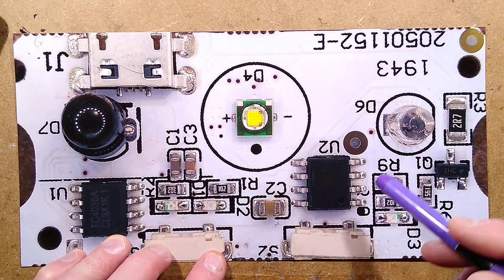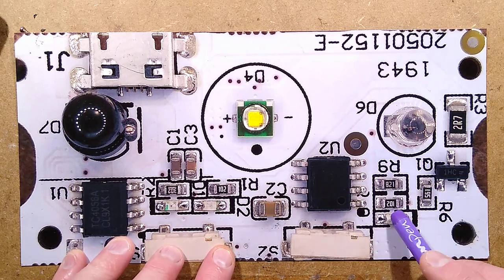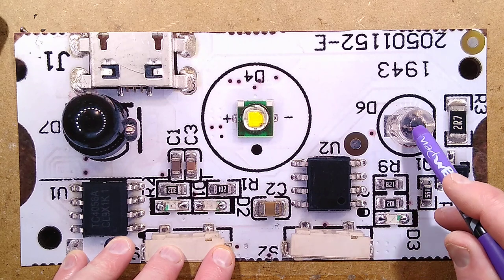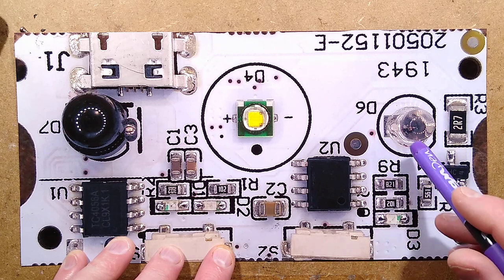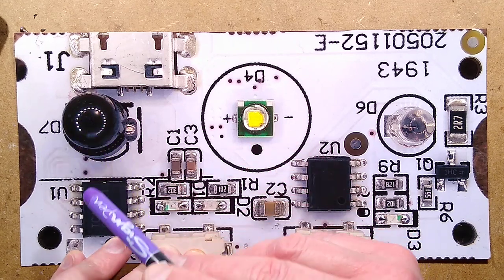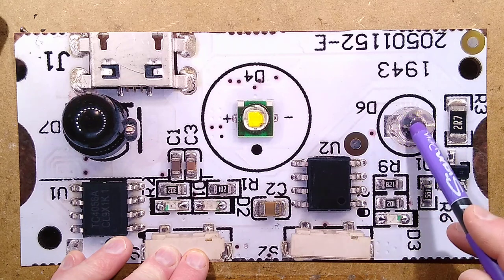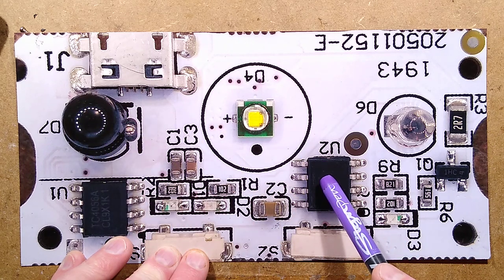The two buttons go directly to the inputs of the chip. The chip also controls the LED that indicates when it's in automatic sense mode — via a 1000 ohm resistor it lights the blue LED, but also pulses the infrared LED via an 821 (820 ohm) resistor. That pulses the LED, which reflects off your hands as you pass in front and is picked up by a three-pin infrared receiver that detects the modulated light. It ignores standard light — it's looking for light modulated at the correct frequency by the microcontroller. When detected, the receiver feeds the signal as a switch output.